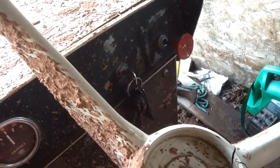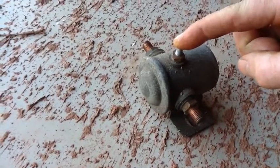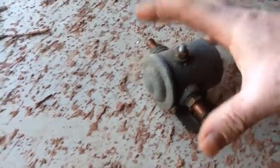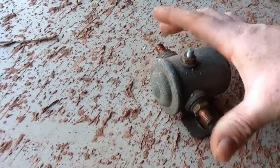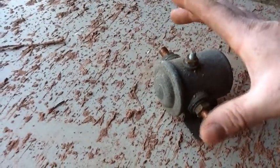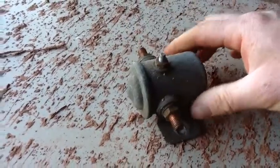So what you do is use a solenoid. I've got an old solenoid here — this is the one that came out of the tractor and it was dead. You have your small 12-volt charge that comes from the key, and then your two large-amperage 12-volt connections which go from the battery on one side to the generator on the other.